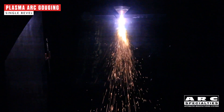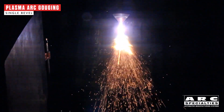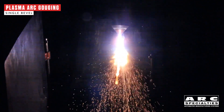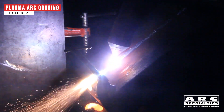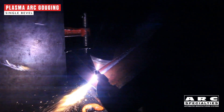If you look closely at the beginning of this cut, we're actually starting out lower to improve our arc initiation, and then drawing the arc back out to an inch and a half. We're running about 150 amps, and we're using air for the cut gas. We've used H35, which is 35% hydrogen — it actually cuts better and produces less smoke, but it's more expensive, so we're going to do it the inexpensive way today in our demonstration.